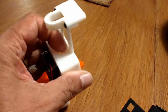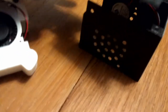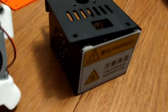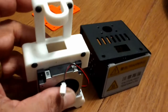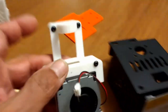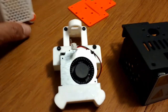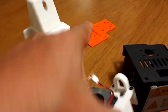Of course it's got to have a little depth to mimic the connector plate area of the original stock enclosure — that's where this comes from. Using common sense design approach, using the exact same parts and profile of the plate, there's no need to make this more complex. I took that and extruded these parts outward in my CAD program — that's how I came up with this particular shape, based on that plate right there.